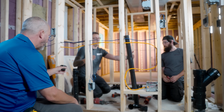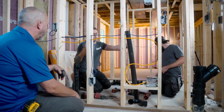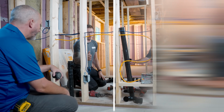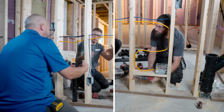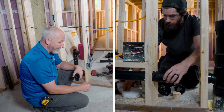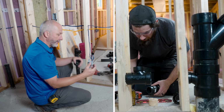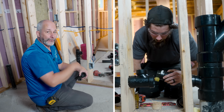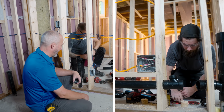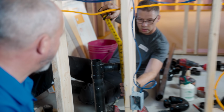So what we're doing right now is, because there was a washer and dryer switch, the pipes are coming together a little bit. So we're going to pass through the wood and then offset one on each side so that they can come through. Because it's 2x6, we have lots of room to put them next to each other. Remember, plumbers are restricted by the code, and they have to follow a certain set of rules. By doing things backwards, we're creating a lot of extra work for them. We're happy to do it. It's nice to work off a level floor too. Good thing someone leveled it.